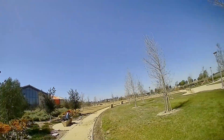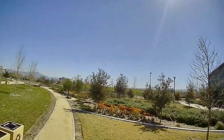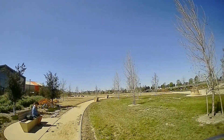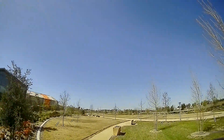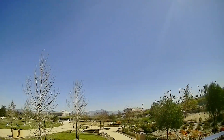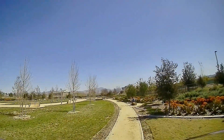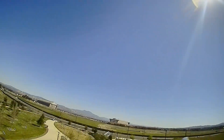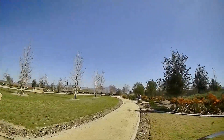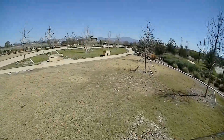You can kind of get around it a little bit if you know how to fly — just don't snap roll it so hard. A little bit less there. If you really snap roll it hard it'll do that bounce back, but if you kind of gradually let the roll stop, it doesn't do that. Anyway, plenty of fly time in this one as you can see — close to six minutes, still almost 15 volts on a 4S850. Yeah, definitely needs more PID tuning.